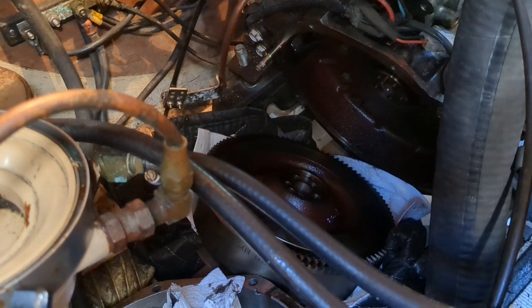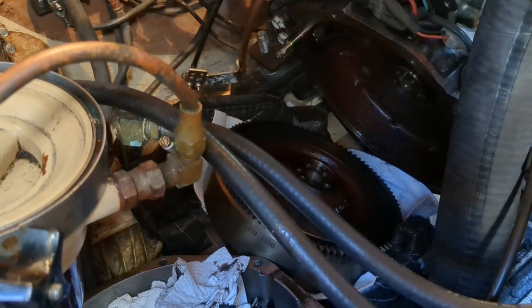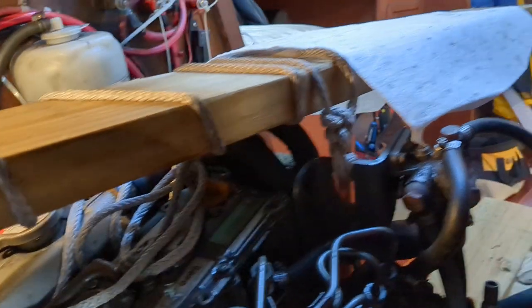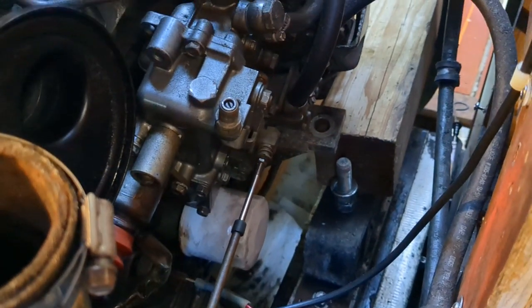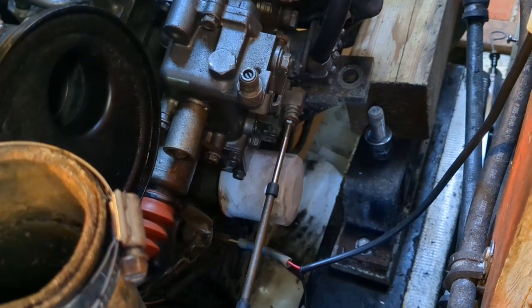So, a couple things. First thing is, I could not move my shaft back far enough, mainly because there were zincs on there, and the water here is just too nasty to dive on. So I ended up having to rig up a board across here, with some Dyneema tied through the lifting lugs. Then I levered it up on another piece of wood that goes across some pretty solid supports, and I had to move the engine forward. So basically I just took it off the engine mounts and moved the whole engine forward, after I had to disconnect the coupling, obviously.